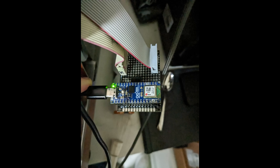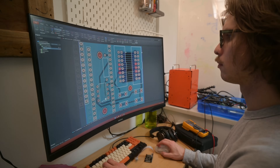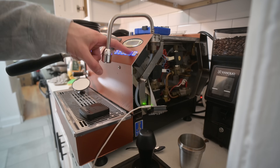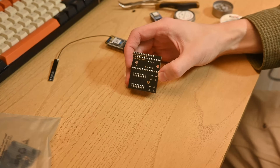As for the rest of the circuit, I just have a current limiting resistor and headers that will house the microcontroller. With the whole circuit designed, I threw together a pretty ugly prototype — basically the same idea, just all wired up manually. With that together, I was ready to test it on both my Sylvia and my GS3, and sure enough I was successfully reading and inducing button presses on both machines. So the proof of concept was proved, and I committed to a printed circuit board. I designed it in Altium, checked it, double-checked it, and sent it to JLCPCB. Got it back in a week — sure enough, there was a mistake. Got it again a week later, and I had a pretty nice board. The soldering process is really straightforward since it uses exclusively through-hole components, which are much easier to work with.